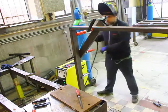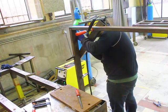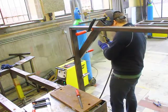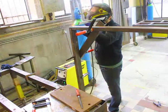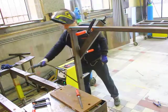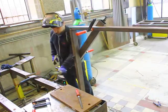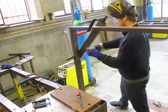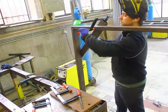And besides, even if it is a bit off we can adjust that with shims once we assemble the frame. The gantry, which is going to be the next segment in this video, was done from 100 by 40 by 3.5 millimeter steel tubes welded up together, and the backing supports are made from 40 by 40 by 3 millimeter pieces cut at 45 degrees. I don't really think they're that necessary but I wanted to add them to give the frame a little bit of rigidity. I'm very skeptical we'll ever actually bend the gantry, but it looks cool and nice.